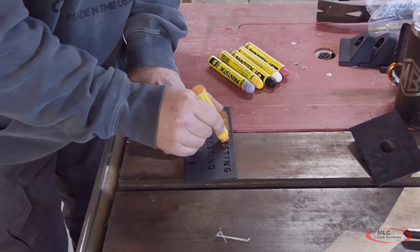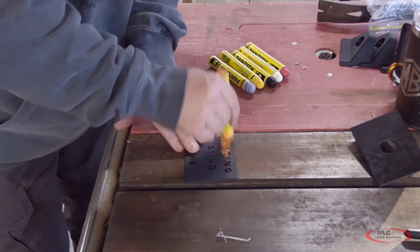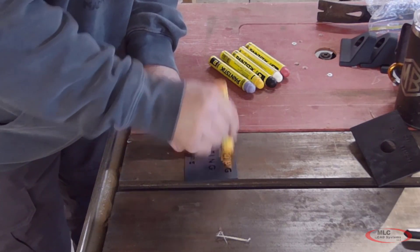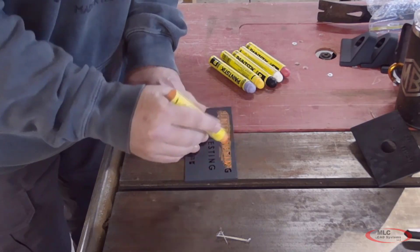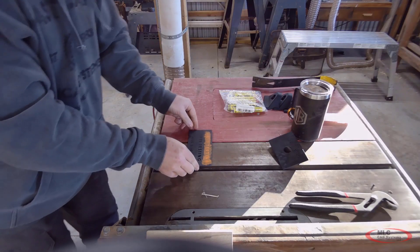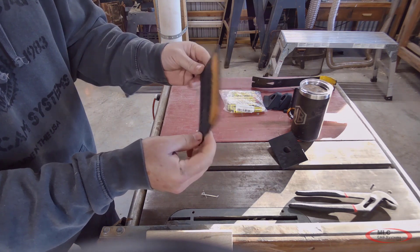In this case, not only did I choose a couple of different fonts, I also created steps of various different depths — starting from a thousandth from the top and working my way down to a thousandth from the bottom. I kind of wanted to see what was an optimal depth. So I printed this tester and started marking it with these paint sticks. It did a pretty good job on the middle ones, which is about what I picked — 50 thousandths deep on text that was about 200 thousandths tall.